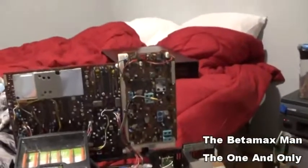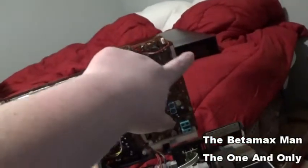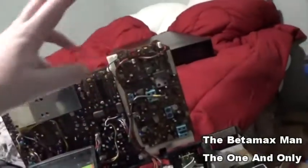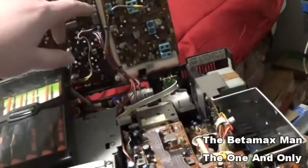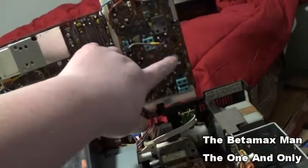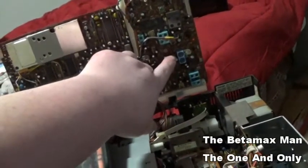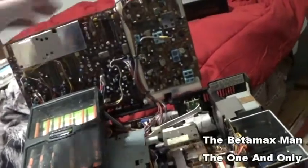Now, yes, there is a piece of the circuit board that's broken, but that's not the issue. I thought that could be a problem, but that's not the problem, because there's no leads or anything that are broken. What one was it over here? It was this light blue capacitor here was bad. These two capacitors up here are bad, and the bigger one, this one right here, tested good still, and the bigger cap on top is bad.